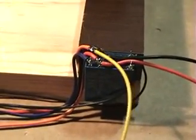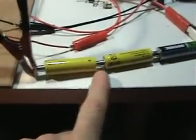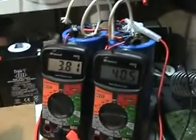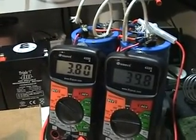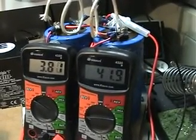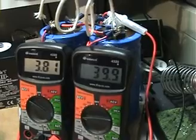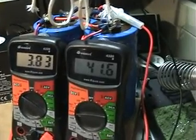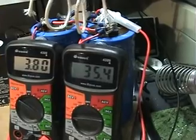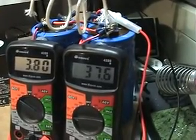The unit is working off three AA batteries in series going to my meter here, and we have about 3.8 volts. The motor is consuming between about 0.31 and 0.47 amps — sorry, 31 to 47 milliamps — so I would guess somewhere around 40 milliamps is what the motor is consuming on average.